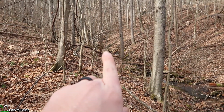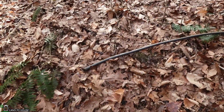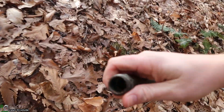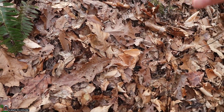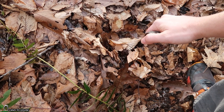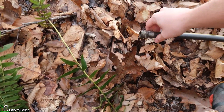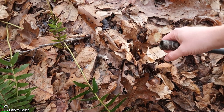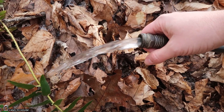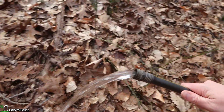The intake is right up here above this little waterfall, and we've already got a drop of about six feet to this point. I'm going to see if I can get the siphon started. Got some dirt in there of course. I can hear some air rushing by there, so we should get a siphon started at this point. So we know that's at least level there. Let's see how high up we can go before it stops.